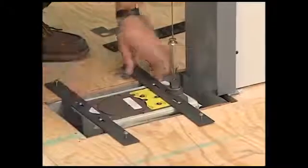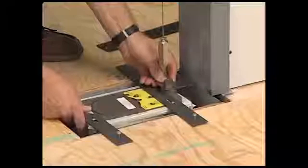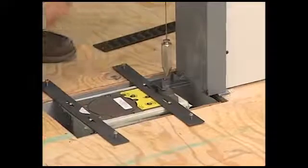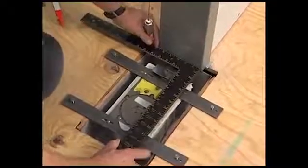Place the spindle locator over the spindle and move the closer into position. This locator is only used when the pivot point is 2 3/4 inches from the frame. Position the closer so the center of the spindle is aligned with the plumb bob. Confirm that the cement case is square with the opening.